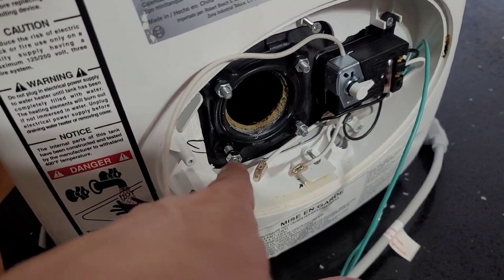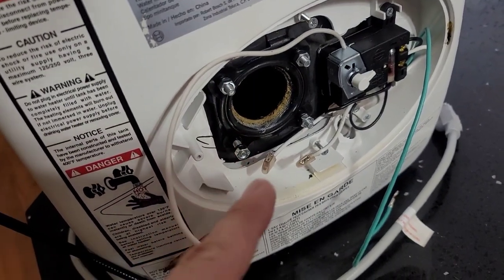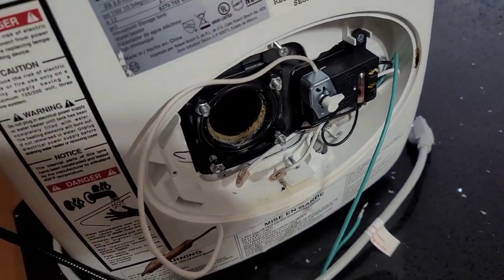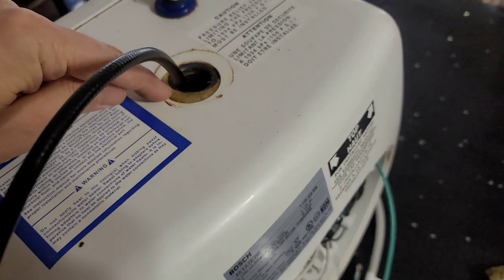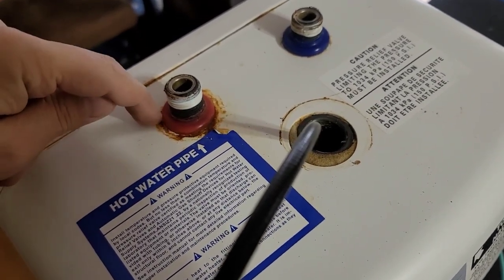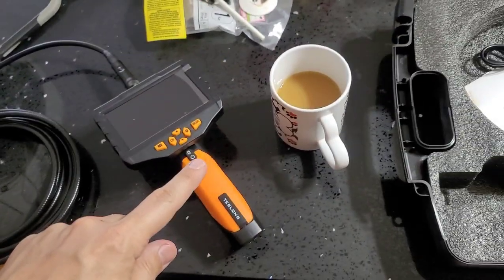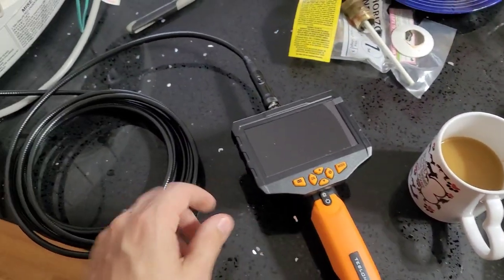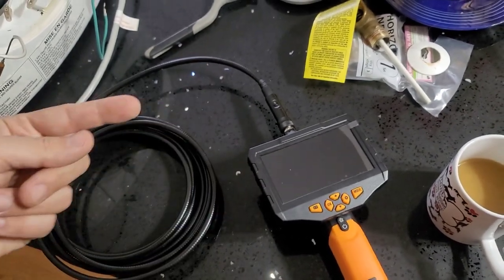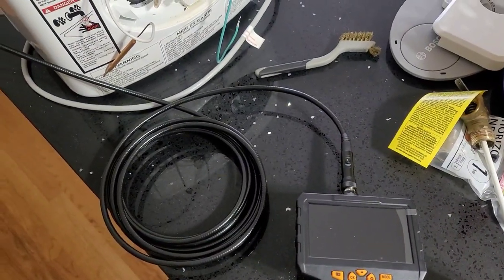It's actually 10 millimeter nuts that hold the heating element assembly in place, which also has the anode rod and then the thermo well for the temperature probe that goes back to the controller. I removed the pressure overflow valve here because it was leaking, and as you can see there's some significant rust around the hot output. I have this Teslong inspection camera and it has the ability to do video — there's a camera that goes straight on and then there's also a camera that's 90 degrees from that — and what you guys are going to see is basically carnage.